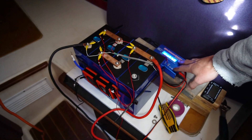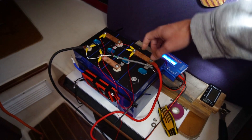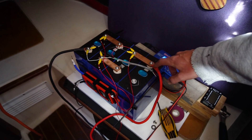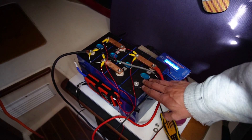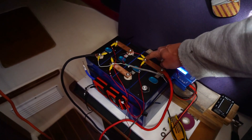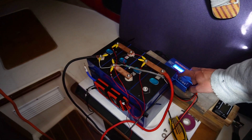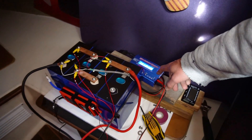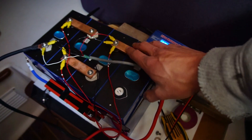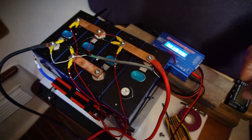After a lot of trial and error and a lot of beeping, I finally got the charger on the right setting. We're charging across the two terminals — this is actually the positive over here, it just looks odd because of how it's connected. The cell that was fully charged is now out of the system, and I've got the balance lead on the positive for cell three, so that seems to be working — six amps going in. I can monitor all the cells and might even be able to balance it like this.